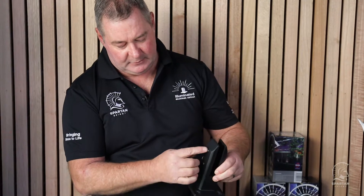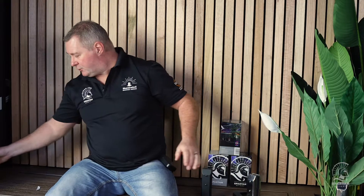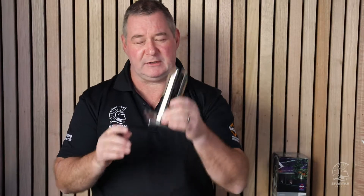The reason the stainless steel insert is so important: when we tighten our grub screws, we can't put pressure onto a normal piece of plastic. We need something solid so the pressure spans across a bigger area of glass, not just in one spot. If you look at a normal spigot, it's solid at the bottom with no hole. You might think you can just drill a hole and put a light in the bottom — do not do that. Drilling a hole in that spigot will weaken its structure, making it uncertified and compromising the integrity of your entire pool fence.